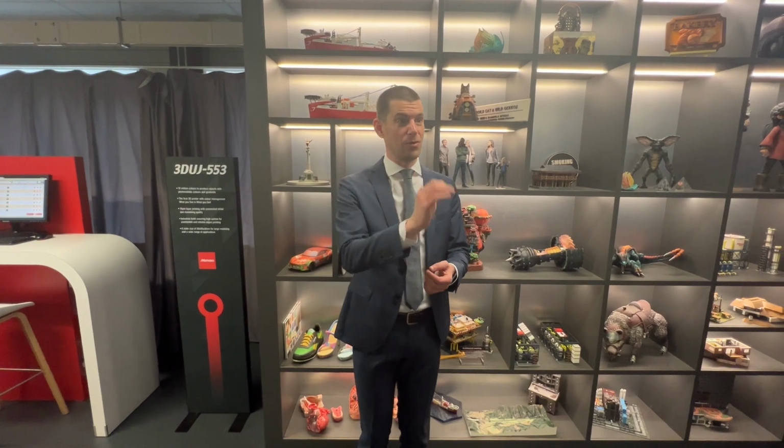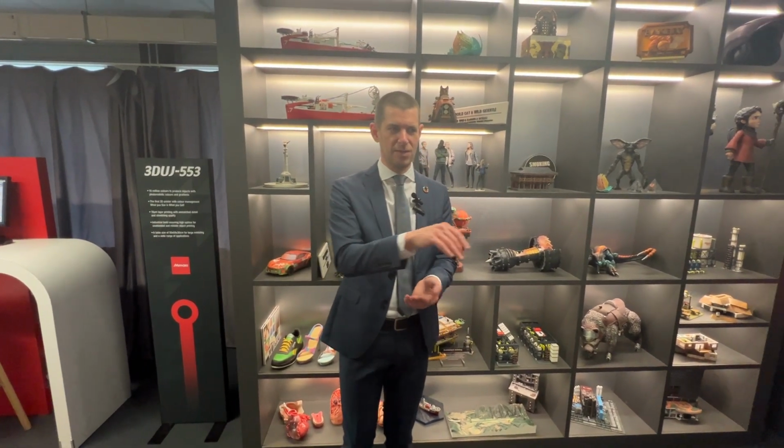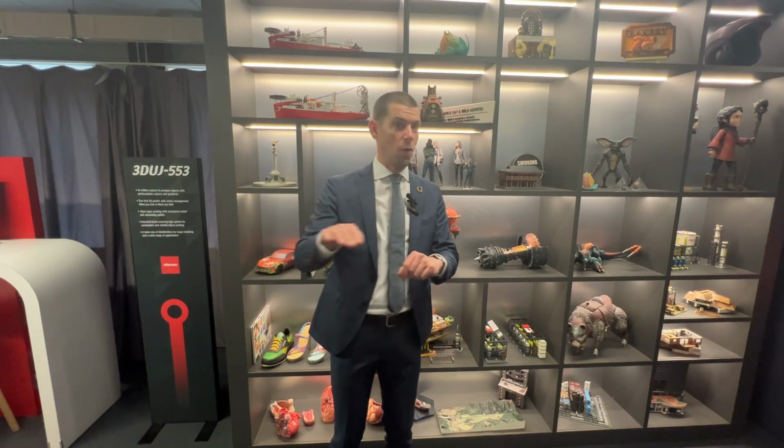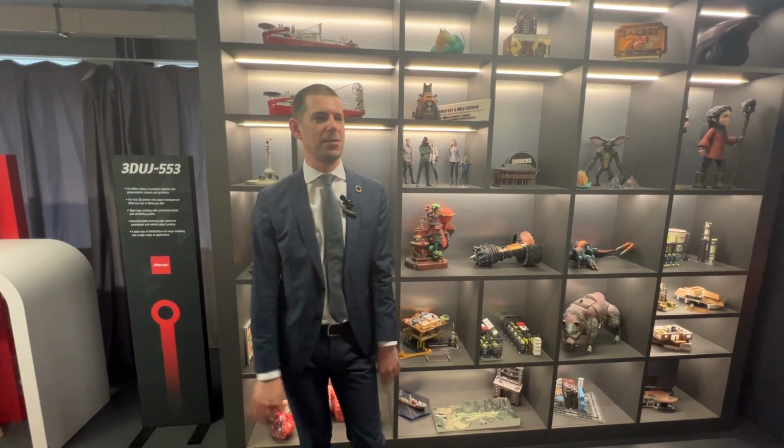If you take a regular UV ink and build up so many layers, you get a lot of deformation, because it doesn't stay in the shape you initially created. You usually get some kind of warping. To remove that, we have a scraper roller. Every layer of UV ink, which in 3D we call material, is jetted, cured, and right after it's cured, a little scraper removes the top 1.5 micron from the layer to make sure it's completely flat before we put the next layer on top of it.